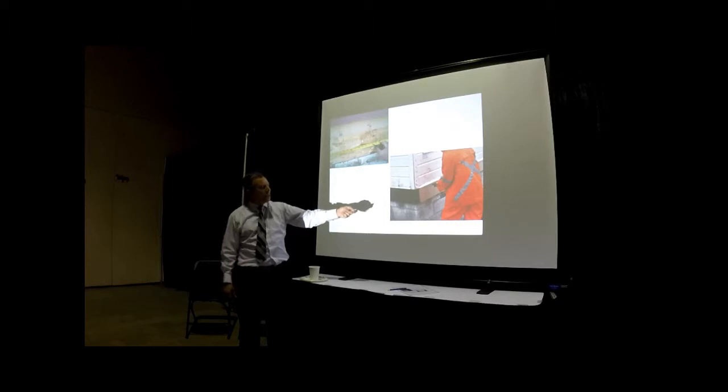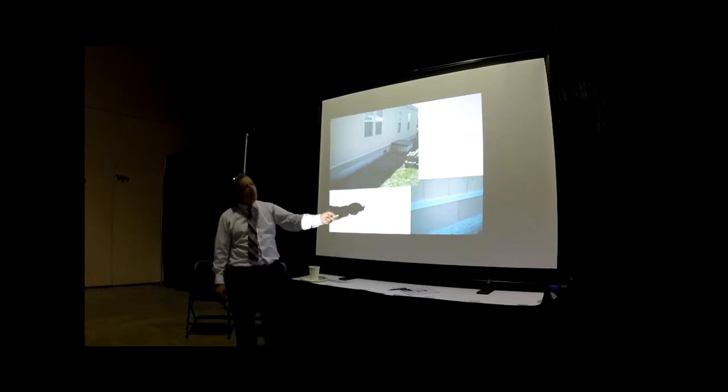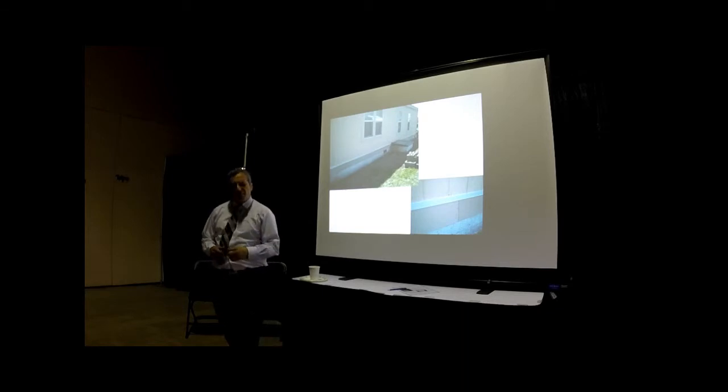As a result, this band area will be slightly sticking out of the norm, so we add what we call flashing on the top so the water cannot penetrate in that band area. And here's how the house looked after we reinforced the stem wall. We have the band, we have flashing, and this is a zoom of the flashing.